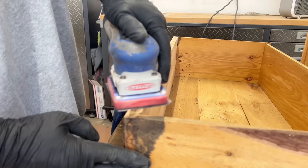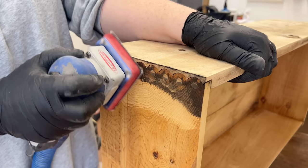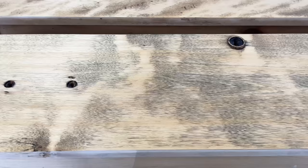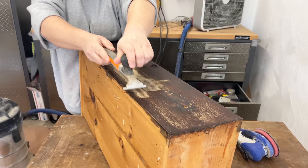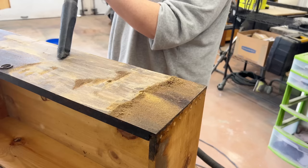I hooked up my surface prep sander to my shop vac and started sanding with some 80 grit sandpaper to start removing all of this, but after sanding down the first drawer I could see that the darker stain that was on top here had actually penetrated right through the original finish and sunk really deep down into the maple wood grain below. Whatever top coat was on here was also really gumming up my sandpaper, so on the next drawer I decided to use my carbide scraper just to help me get that layer out of the way first,